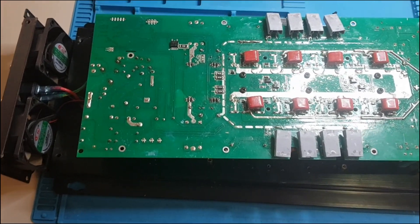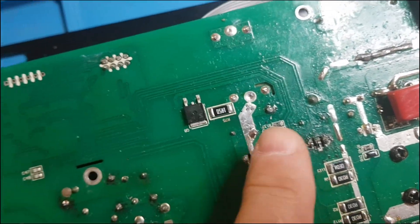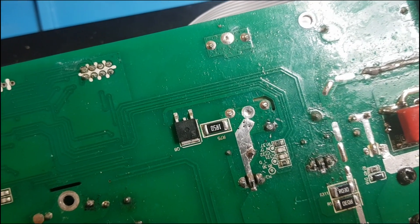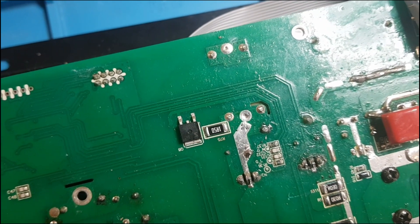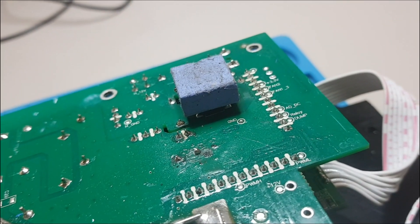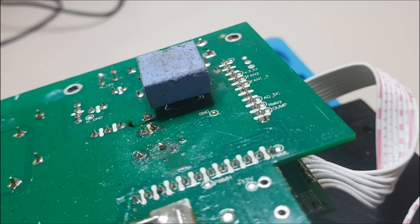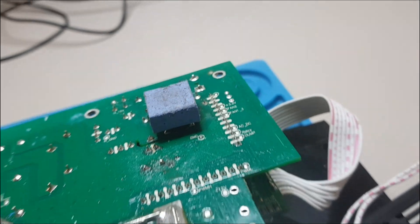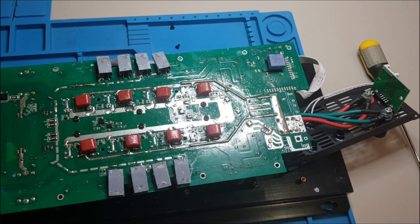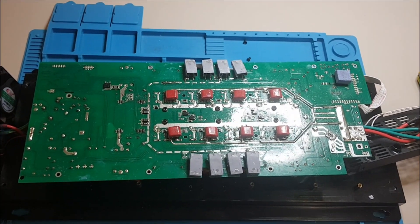Starting on the back side — what I had to replace is this 1.5 ohm resistor, some sort of shunt resistor. I don't know exactly what it is for, but it was blown — reading as open. The second thing on the back side is the power supply control chip, which came from a donor board. The reason for this change was I did not have 12 volt output on the internal power supply.